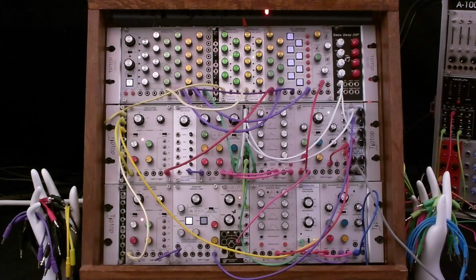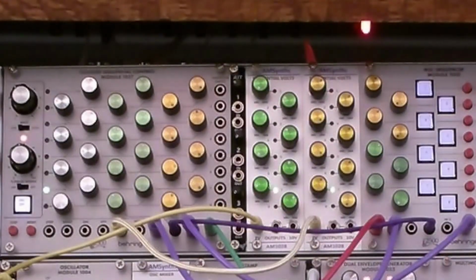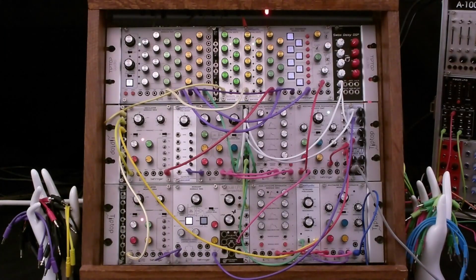It's virtually impossible to take the 10-volt output from a Behringer 1027 sequencer channel and tune an oscillator to a precise pitch. This is a 10-octave tuning range. I always use an attenuator to get the range of each channel output to either 1 volt or 2 volts. It's easy and inexpensive to add a 2 HP passive attenuator to your system to limit the range to 1 or 2 octaves. It does, however, introduce the possibility of the attenuator becoming knocked out of adjustment and losing the tuning for the entire channel.